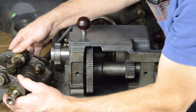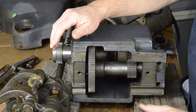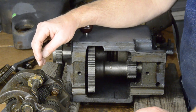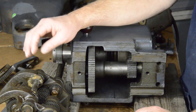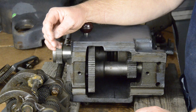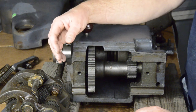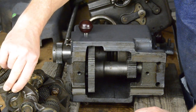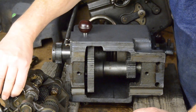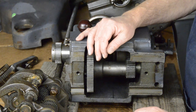What happens is the grease does a couple of things. It does make the gears run a little smoother for a while until all the grease squeezes out, but it's more of an attractant for swarf and chips. They will attach themselves to the grease better than to oil. Oil, if you oil something regularly, tends to move things through the system rather than keep them in it. The other problem is that these levers don't hardly move because there's so much caked-up grease on the shaft that has basically got everything seized up. I may have to take that apart and redo the quick change gearbox too.